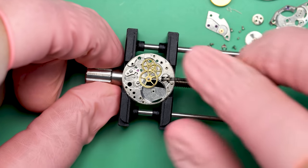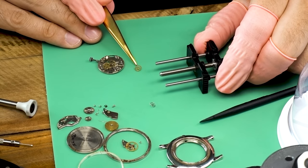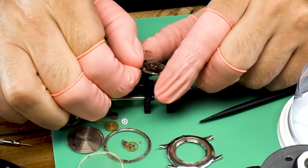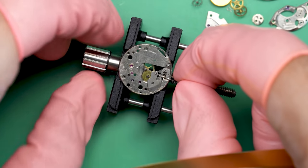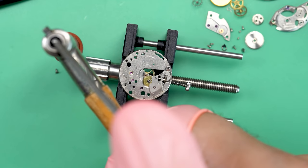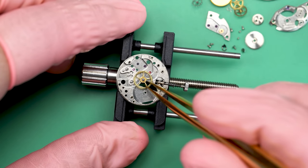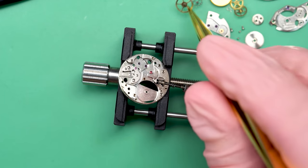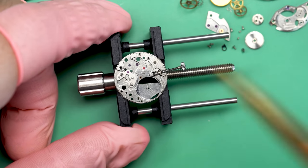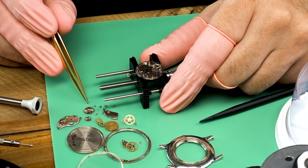We'll take the barrel out. But I realized I haven't actually taken off the cannon pinion, so I'm going to flip things over. The train wheels are going to come out, but if they fall out that's one thing — if you try to yank them out that's a much different thing. The center wheel is attached to the cannon pinion on the other side, so it will not come free until I release the cannon pinion. Using my handy cannon pinion remover, it safely and cleanly removes the cannon pinion. That's something we're going to want to take a look at, because if it's too loose, that could be why the hands are falling out of alignment.